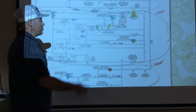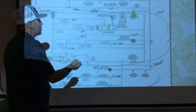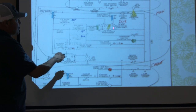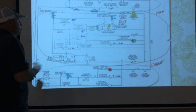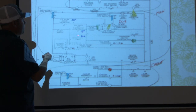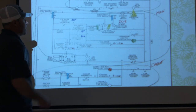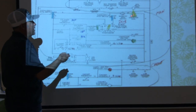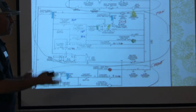Simultaneously, we bring on the compressor contactor, which up top brings on the compressor, simultaneously closes this contact, which brings on the solid-state timer, closes terminals one to two, and brings on our beater. Now our beater assembly is turning and churning ice cream. The compressor runs until it gets to 18 degrees Fahrenheit — the TC opens, which de-energizes the cylinder solenoid and the compressor, opens this contact. Because it's a delay on break, this contact stays closed for an additional five seconds, keeping our beater churning, then shuts off the beater. Now we're at consistency and ready for an ice cream.